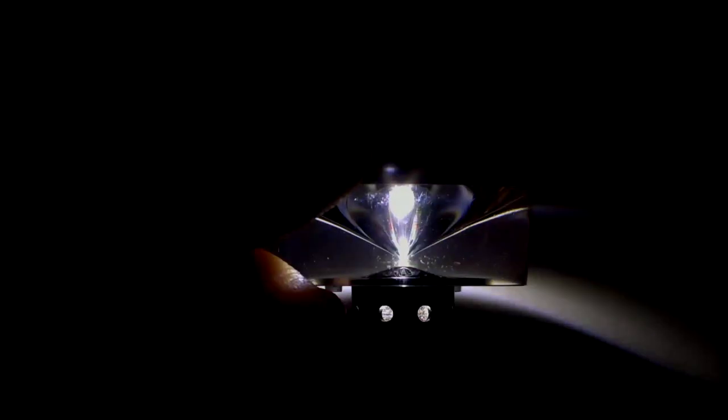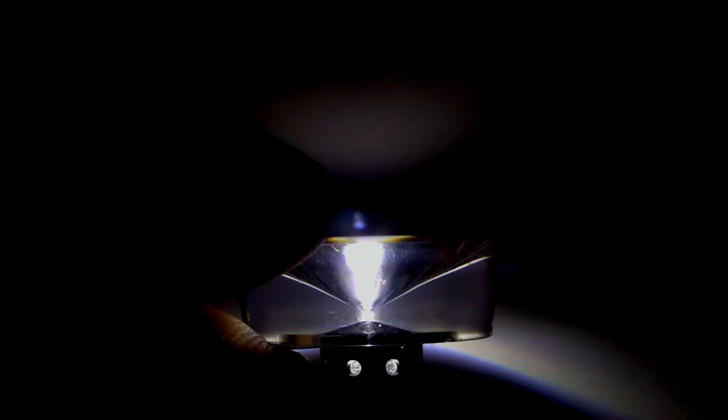Now let's have a look under the microscope. That's a good one here — I broke it off from a good original LED. We see it's really clear. Now if we take the one that was on the faulty LED, they look like frosted glass on the inside. It's not glass, it's plastic, but it's like frosted — it has some deposit on the inner cone. The part inside of the lens should be absolutely clear, otherwise the light will not come through as it should. This one here is a good one, shining with a flashlight through it. And this one here is the one that has the deposit on the inside. We can clearly see it's not the same thing.